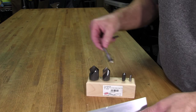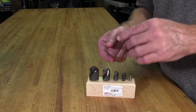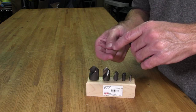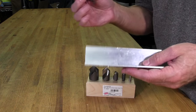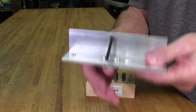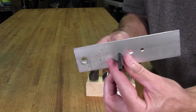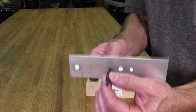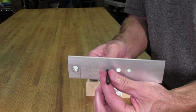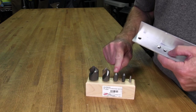We drill to the right depth. And you have to kind of test to do that because I don't have the specialized equipment where I can just measure the depth it's got to be and then set my equipment up. My equipment's just not that precise. Not a $110 drill press, not going to happen. So anyway, we were able to get this nice and flush the way we want it to. But now you can see there's not much play in that screw at all in the back, just a little bit, which is okay. You don't want it super tight. So now we have the hole size that we want, and we know which bit created it.